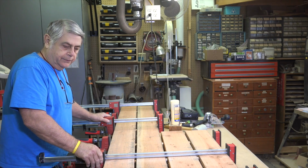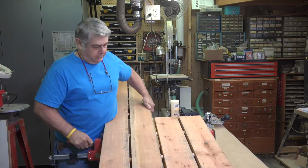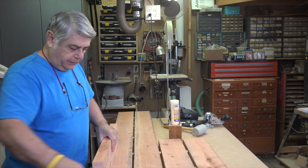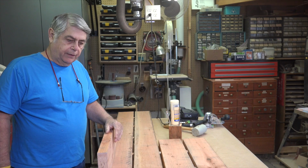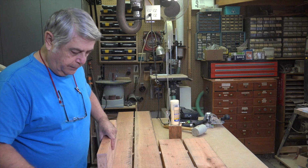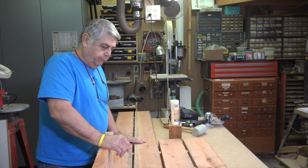I've left this set up all night, so it's time to take the clamps off and see how we did. The next thing I will do is add the sides to this, and create a depth of probably 5.5 inches to plant. And I'm just going to stand these up on their end and probably put some dominoes in it to help it stand up. And mate the corner. Build a box the whole way around it and then fit it onto the bottom.